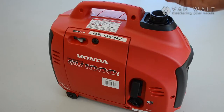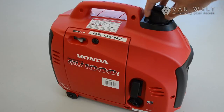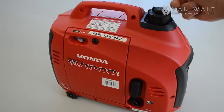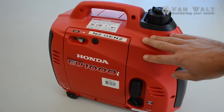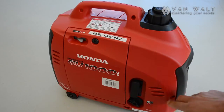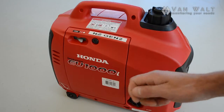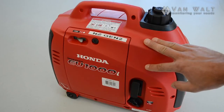Once you're ready, try to give that as much time as you can, then put the cap back on in the closed position. And I'll remind you: when you get the generator, before you start it, turn it over a few times with the switch in the off position, just to make sure there's no resistance and no excess oil in the combustion chamber.